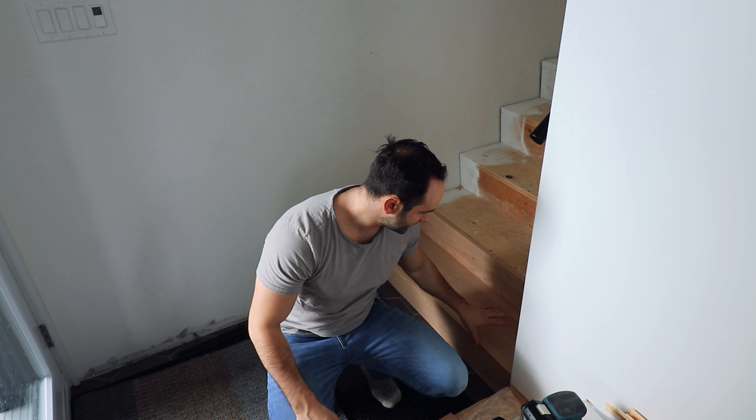He's just about to do the first tread. You can see it's kind of in place here. Ben's put together a few stairs at the bottom. It's been pretty tricky to figure stuff out because essentially the stairs were done at ten and a quarter. Just buying a typical stair tread from a big box store, they're about ten and a half inches, but that includes the bullnose. It was much more expensive to get a stair that's deeper. So we went and got regular red oak stair treads from Rona and cut them at the angle to match the stair. Ben's going to run you through exactly how it's put together.